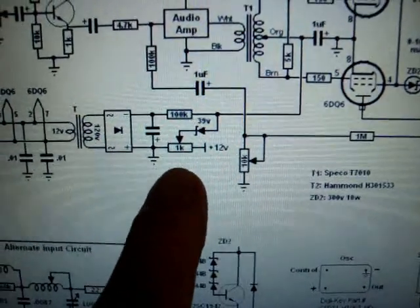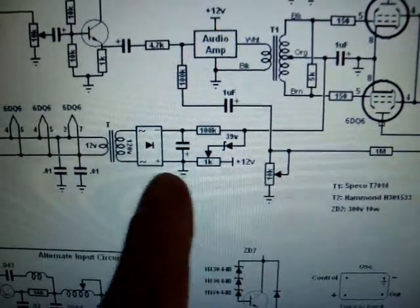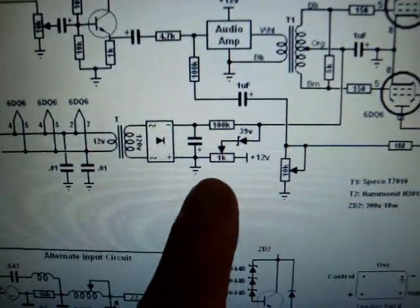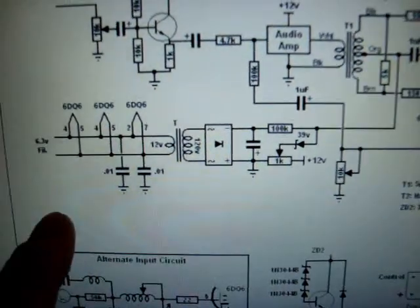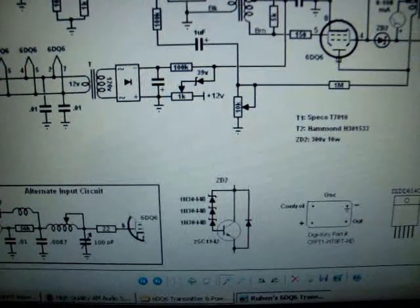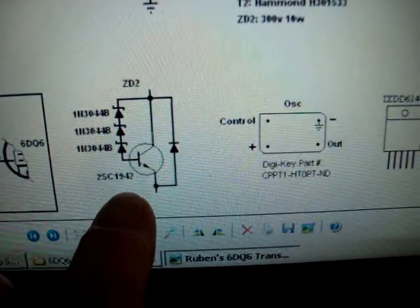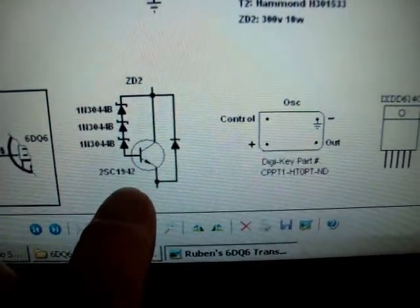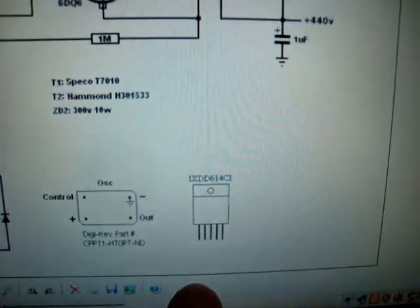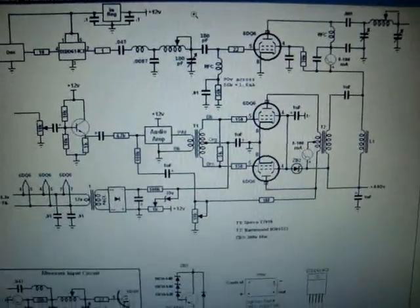Here's the bias circuit. I had to play a little biasing trick using plus 12 and minus 60 volts negative. I won't go into it a lot — it's just a trick I used. The 3 filaments come in from the 6.3-volt side. And down here I show my screen dropping circuit — it's actually off the regulated B+. So everything's well regulated in this. So there it is — that's actually the whole transmitter, schematic and all right there.